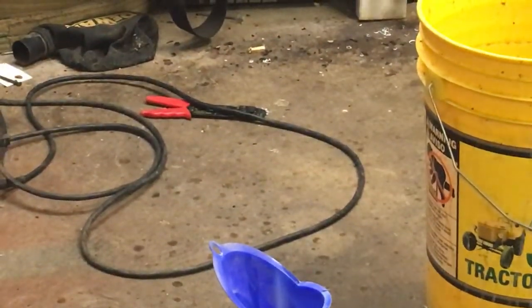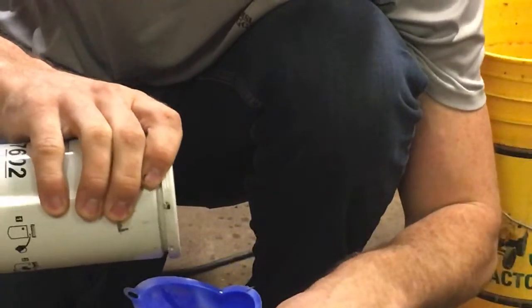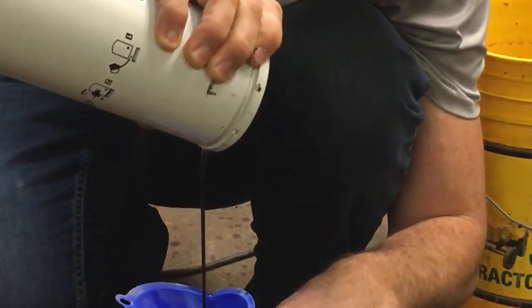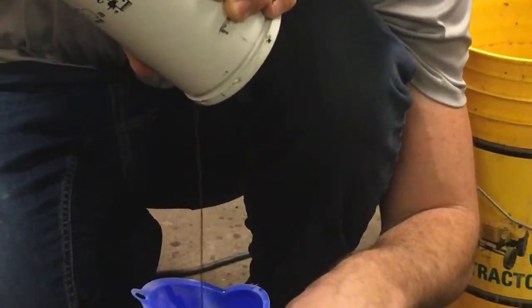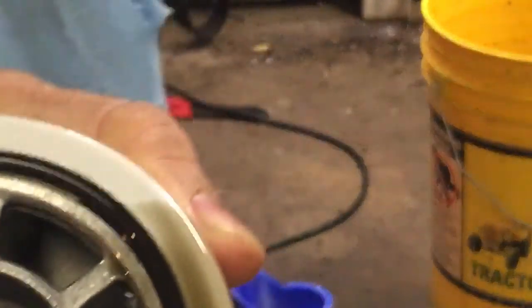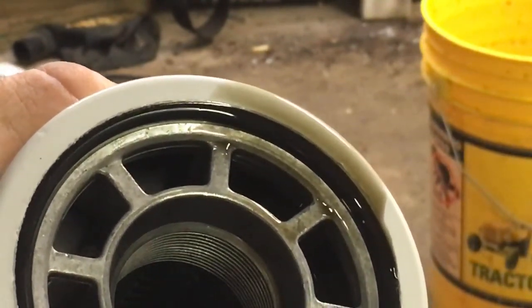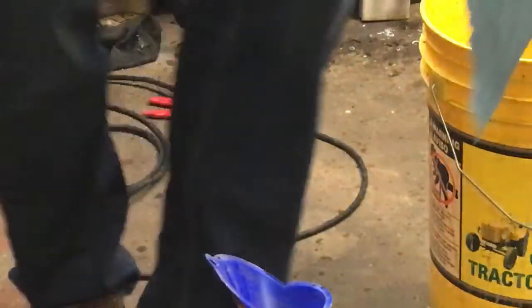The machine is acting exactly as it always has — it's not shifting hard, not slipping, none of the telltale signs. I'm going to pour this one out. That looks awful — not black but gray. It's making me wonder if I had excess residue or just bad, dirty oil that needs changed. It's still pretty transparent. You can see against the white there's definitely residue, but I don't know how bad.